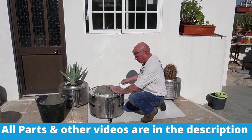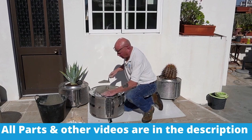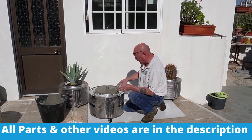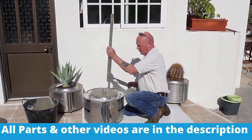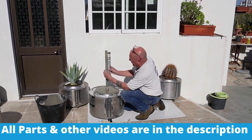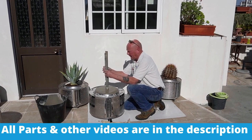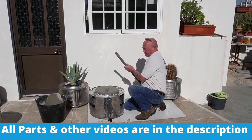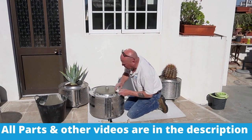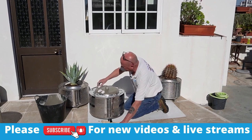Try to have a little bit of slope from the middle going outwards so that any rainwater runs freely off. Put a bar down through the tube — this will allow you to make sure the tube is level, because when you put your clothesline up you don't want it leaning at an angle. Once it's level, carefully lift the bar out, then you can set pebbles into the concrete.